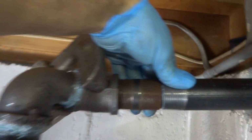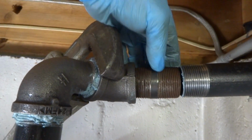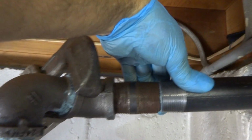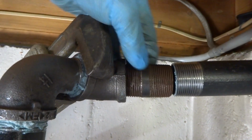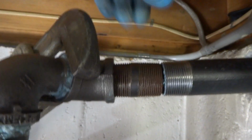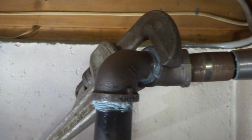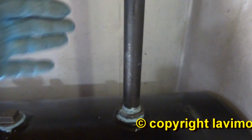Tip my father showed me. If you can't line up a pipe, put a nipple in there and you'll be able to see if you gotta spin it a lot, see if it lines up. See, that should be able to go. I couldn't get that pipe in there. You put just a nipple and it'll tell you if you gotta adjust it, because I gotta put a swing joint. I'm going an elbow and a 45 because I don't wanna come too far off the wall.